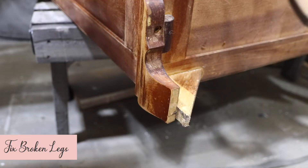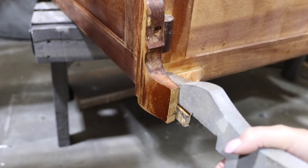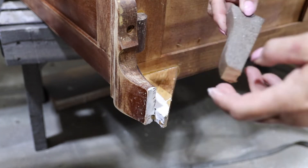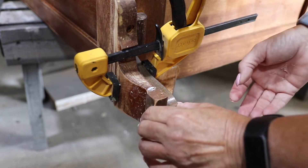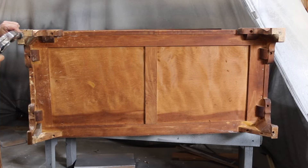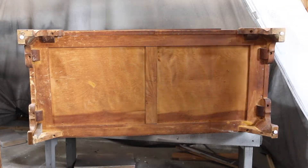One of the only repairs we had to do on these pieces was to fix the broken legs. One leg was a simple glue and secure, but the second was trickier because we didn't have the broken section and had to rebuild it ourselves. Since we don't have a scroll saw for more intricate wood carving, we ended up using a few pieces of scrap wood that had a similar shape to the other legs. We cut the pieces to size, secured them with wood glue, and clamped them in place. When the glue was dried we reinforced it with a few screws. We ended up with a pretty good matching leg, and once it's painted you'll barely be able to tell this section wasn't part of the original piece. After we repaired the legs we also added hard plastic furniture leg sliders — moving furniture without these can cause scratches on floors and will cause the legs to loosen or even break, which is likely what happened to this piece previously.